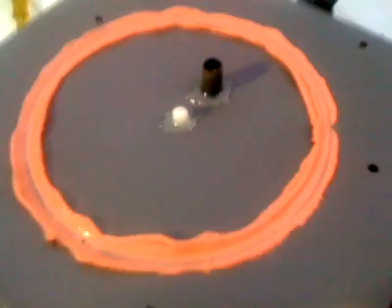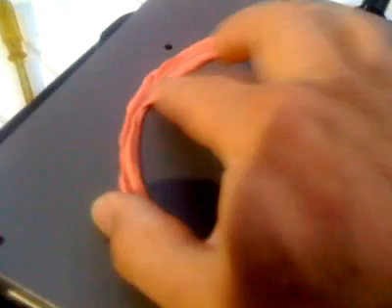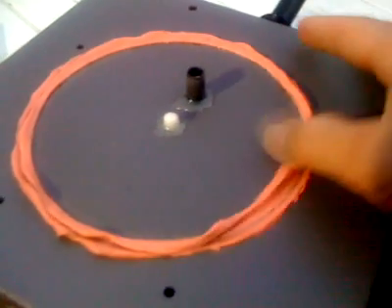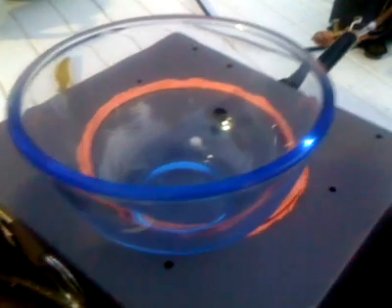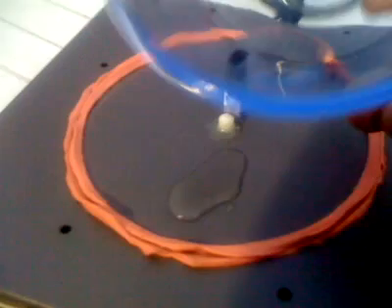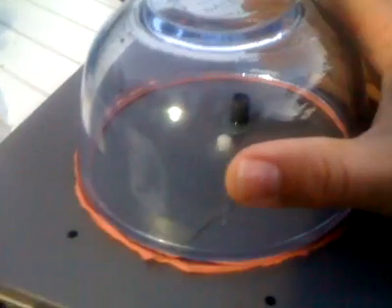My seal on top of the test bed is just kids play-doh, and probably what I'll do before I put the bowl back on is just squish this over so that I've got a nice bit to suck down on again, because obviously it does get squeezed out from underneath the jar when the vacuum comes on. Here's my jar which is just a standard kitchen Pyrex bowl. Obviously I'm wearing safety glasses — I'm sure this is plenty strong enough but I wouldn't like to find out the wrong way. I've just dropped a bit of tap water in there and then we can position that on the putty.